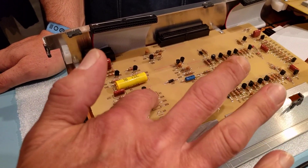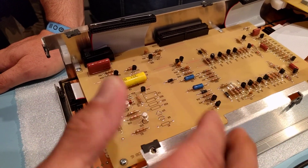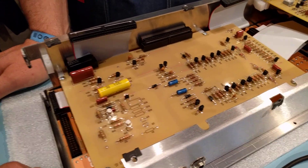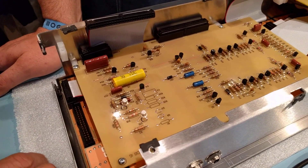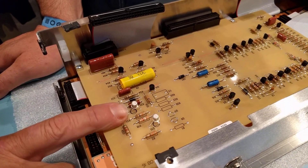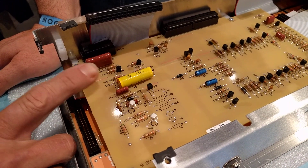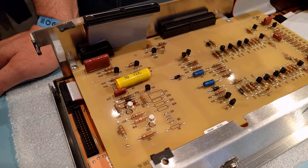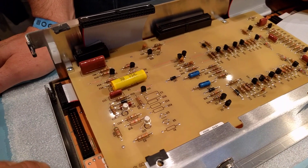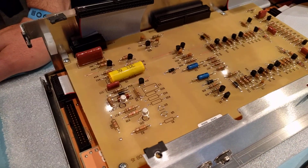So we don't need this current source anymore. However, since we duplicated the circuit boards exactly, the locations for the components for the current source are still there. We do use the analog sample-and-hold and the analog glide circuit to faithfully reproduce the up and down time constants for the glide circuit when glide is enabled. That's why those parts are stuffed — it's true to form on the original.